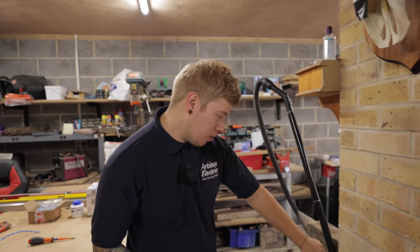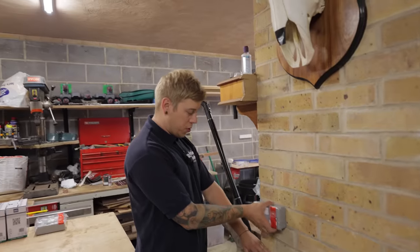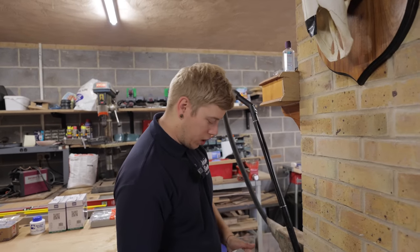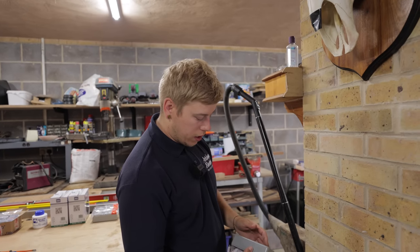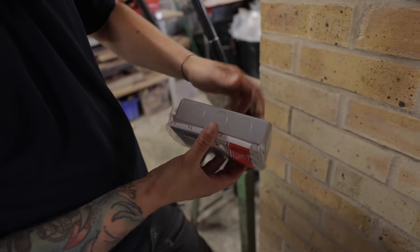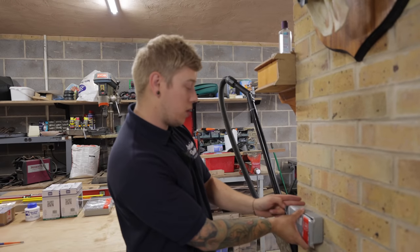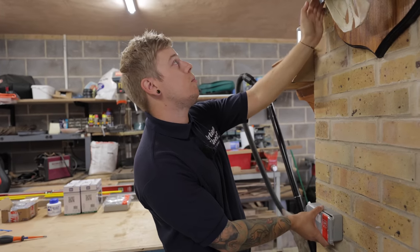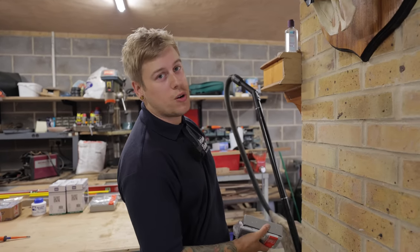Over at the column I've made a little mark - that's the top of my workbench - so I'm going to go on the third brick up just to allow a nice bit for the plug. A good thing before you start mounting your box: you've got different knockouts around it, so check what way you want to do it. I've got two on this side, flip it around I've got three on this side. I think I want the one with three - we're going to come up the edge of the column and do our tube behind the skull.